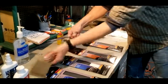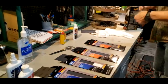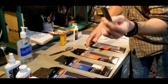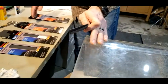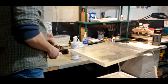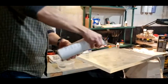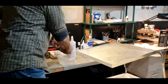I'm cutting pretty small pieces off like this. I'm actually starting with 400 and folding it like that, and I'm doing that with each one. We're going to wet sand, but because these scratches are so bad on the bottom, I'm going to start with 400. If they're not that bad, you don't have to start with 400 — you can start with 600. I keep a little thing of water here, dip the sandpaper in. What's even easier is to spray the bottom of the chair with water and then use your wet sandpaper.